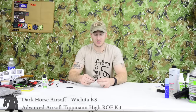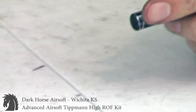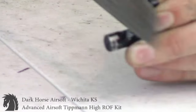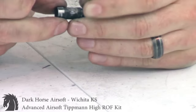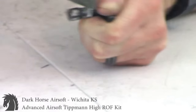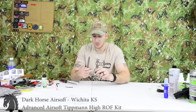Another modification: here's your selector. Your detents are over here — as you flip it from safe to semi to auto you're going to have these little cutaways. What you want to do is free these up as much as possible, so take a file or Dremel — whatever your tool of choice — and simply create some clearance on both sides. It's not going to take a ton, but enough that everything is as free-moving as possible. If you want to get the most rate of fire this kit can give you, you need all the pieces moving as smoothly as possible.